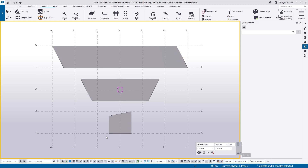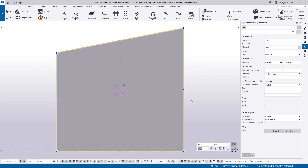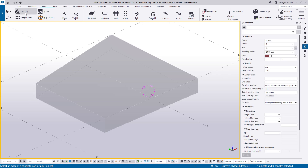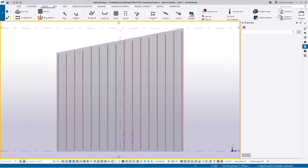The focus of this exercise is to understand tapered ranges, understand the settings Tekla gives us to work with tapered ranges, and then optimize these bars to reduce our bending schedule length. I'll fit the workspace and switch to a transparency 3D mode to see what we're doing. I'll start by loading my defaults to cancel any settings I may have made, pick a 16mm bar, and put in some basic reinforcement. Tekla has already given us some form of a taper, grouping two bars together.